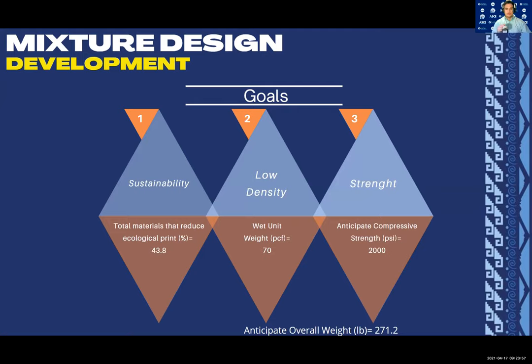With the current rules and regulations, our team decided to incorporate our 2019 concrete canoe into our mix as a recycled concrete aggregate. Also, we currently have in stock and properly stored some of our aggregates and fiber mesh from previous competitions, eliminating the need to purchase them again. Finally, consulting previous captains and students, we collected feedback on what changes could be made regarding procedures and admixtures used to predict how our mix will behave.